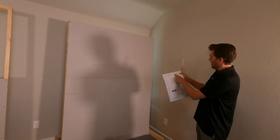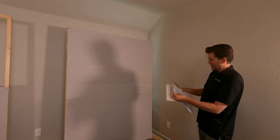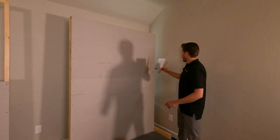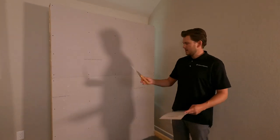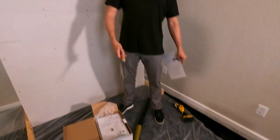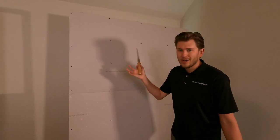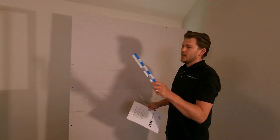You can see they have the actual size of the speaker and then the actual size of the cutout hole — that's what we want. I'm going to tear that off and put it on the wall in the location that we want to mount the speaker. A couple of tools you're going to need: a drywall saw — you can either do it automatic or kick it old school, which is the easiest and cheapest way to get it done at home. These are like five dollars at Home Depot. And then you need a level — you want to make sure that it looks good.